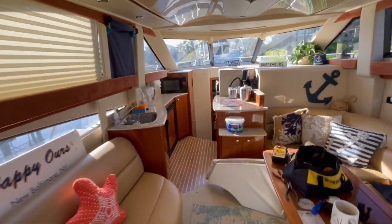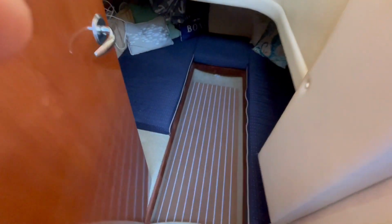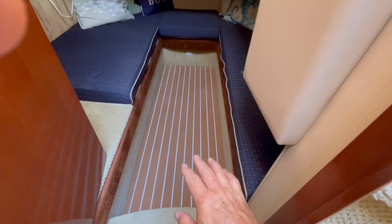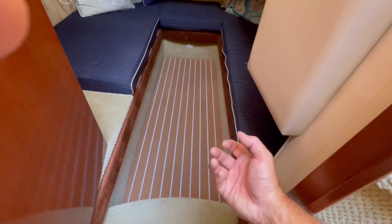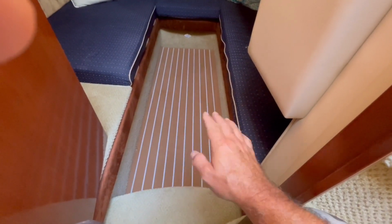If you follow me on YouTube and the videos that I do with the maintenance down in the mid cabin, you may have seen when I replaced this mid cabin floor a couple years ago when I bought the boat. This floor seemed a little spongy. I cut it up and found the wood was rotted from water damage right underneath this. So underneath this floor, the hull is only a couple inches below it. So it's not deep enough. There's no bilge pump there, but any water that collects in this low point in the bilge is supposed to drain to a bilge pump that's underneath that seat there.